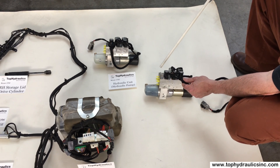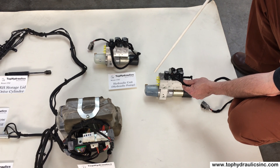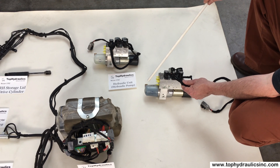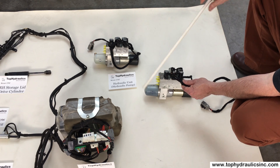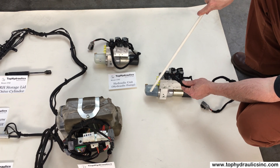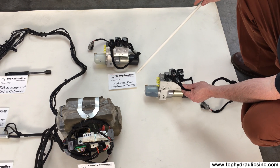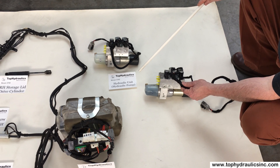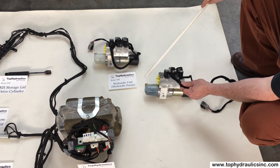Having such dark fluid in your system is a sign that the system has been taxed quite a lot, that the fluid is old, and that you may get a failure fairly soon. You can purge this fluid — it's not completely trivial, but if you want to do preventative maintenance, you could siphon all the fluid out of this pump, then move the top manually to basically pump the old fluid from the cylinders back into the reservoir, and then siphon the fluid out again. Do this a couple of times, then fill with new fluid and you have fairly thoroughly flushed the system. It does not take care of the cause of decay of these seals, but you can get a little bit more life out of your system if you do this kind of preventative maintenance.